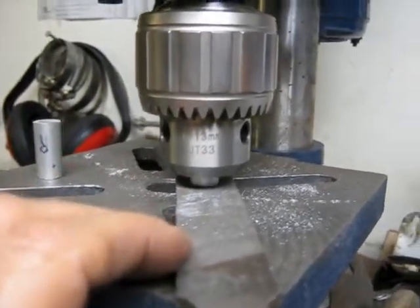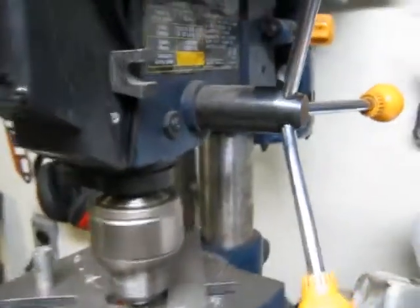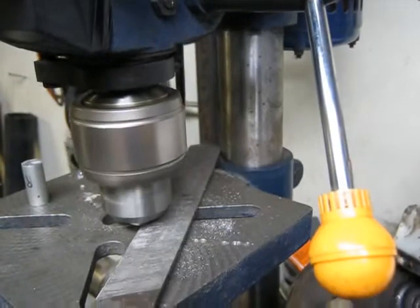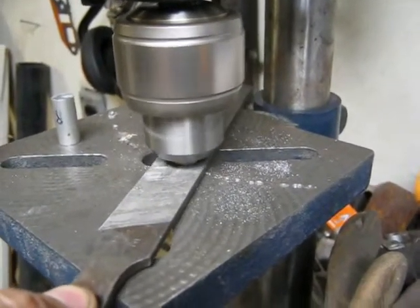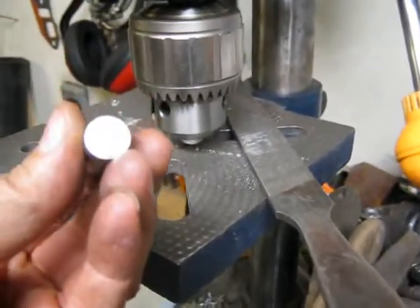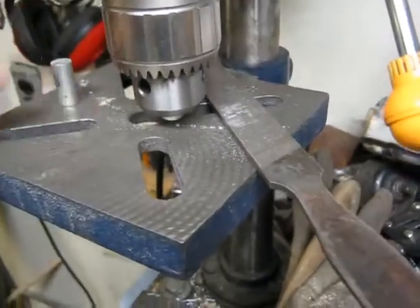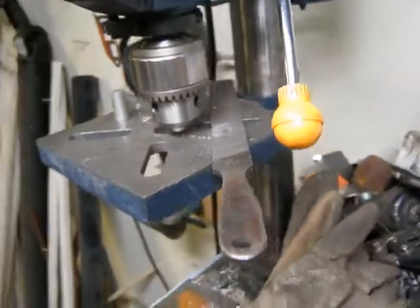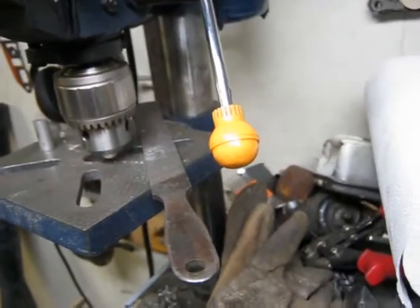I'm only making the end flat on this, so I just turn it on, have it against the far end against the tool post so it can't rotate, then go up against it, take it easy and move around a bit. It will machine them kind of flat on the end and make them square and true — a lot better than a hacksaw or just filing will. So this is my version of Lee's lathe.